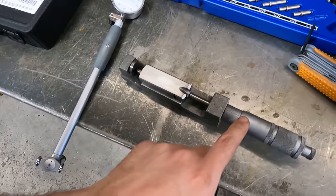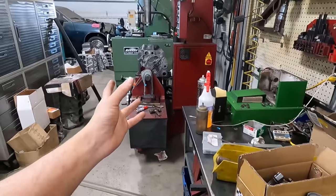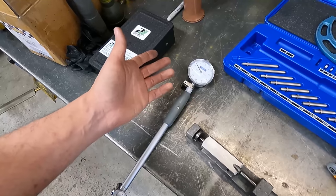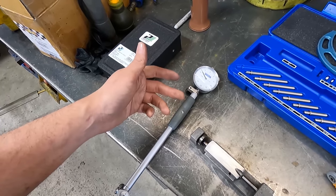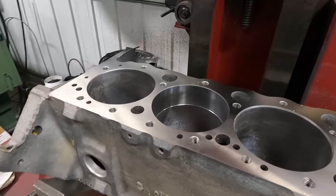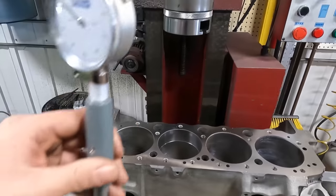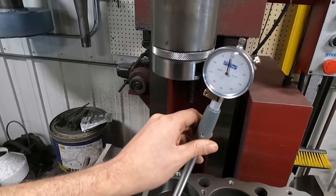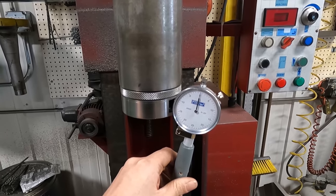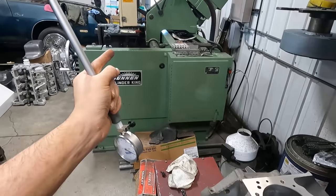Normally if you were going to 20 thousandths oversize, you leave a few thousandths so that you can finish it in the cylinder hone. But in this case, since I'm just testing the cutter, I went straight to 4020. I'm using this Fowler $100 bore gauge that I made a video about a few days ago — one of my shorts videos — and I set it right at 4020. The surface finish looks pretty good, it feels nice and smooth, and we're right on the money. I'm going to set the cutter to around 4026 so we have four thousandths left to hone.